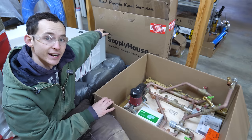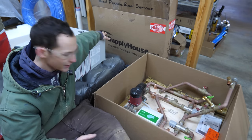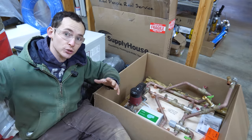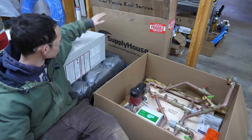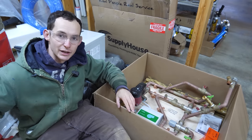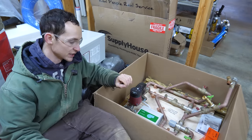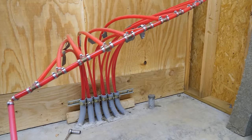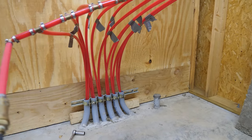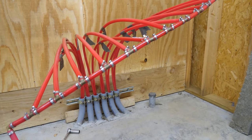The boiler has clearances I have to meet: 12 inches minimum from the ceiling, 3 inches from walls. So I have to keep all that in mind when choosing locations. I'm going to start with mounting the boiler and board first, not the manifold. The manifold has to go just above the tubes, but I need to know what height to mount it based on where the boiler and board go.